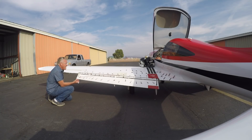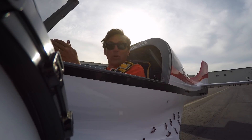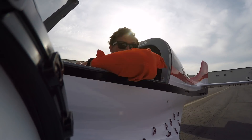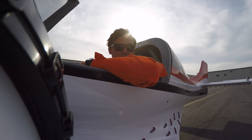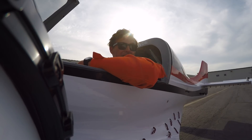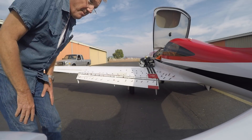You also increased the wing area. From what I can see, you should see an 8 to 10 knot difference — this is like a normal flap, and they stall right here regardless of what they do. I was eyes forward; I didn't look at the tufts during the stall, I was on airspeed. I was thinking about whether, with the elevator all the way up, that camera is going to catch the tufts on the elevator. I just hope we didn't lose any information.